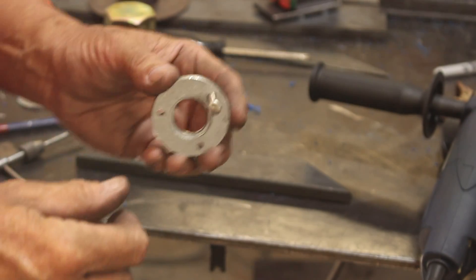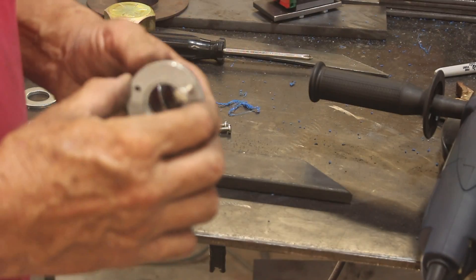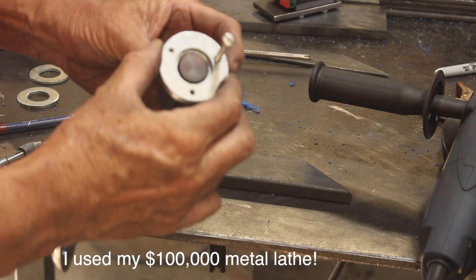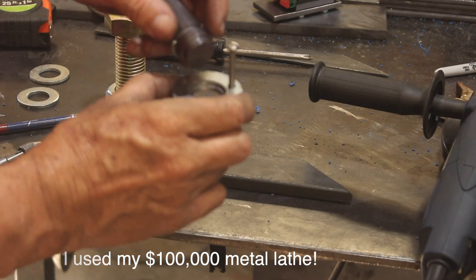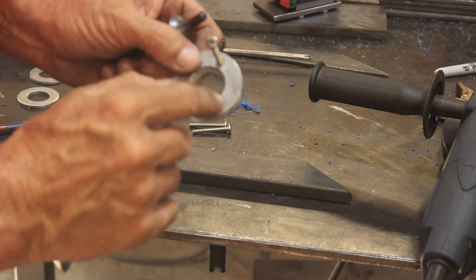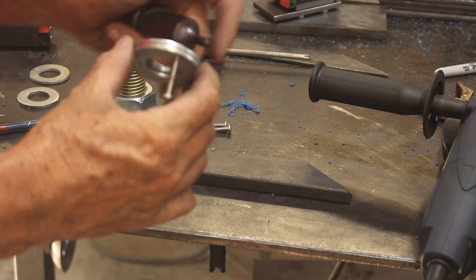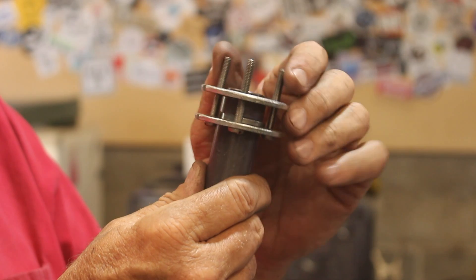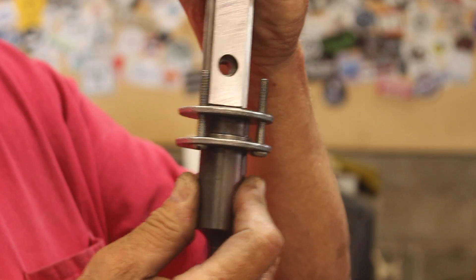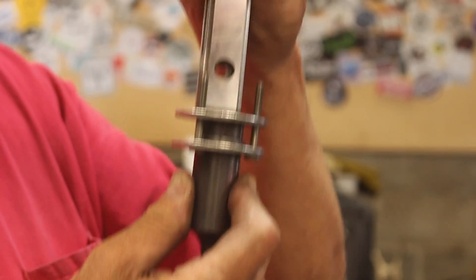I'm jumping around a little on the progress here — before I start welding I want to make sure I have the punch holder made. What I've done is enlarged the holes of these washers: one to fit the little neck-down area of the punch, and the other to fit the major area of the punch. Then I've drilled three holes in here, I'm going to tap threads into them, and these washers are going to sandwich the punch into place and hold it. We'll just weld that onto the end of the rail — there will be no side-to-side play, and it doesn't need to be very strong because all the force will be straight up and down.